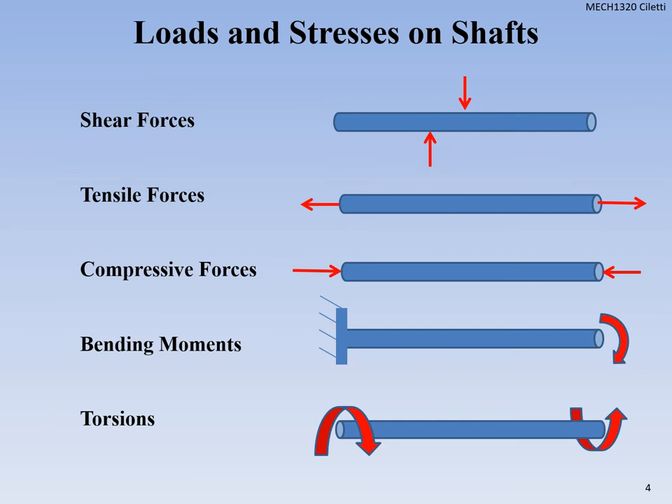Different types of stresses and strain act on shaft material. We have shear force — those are perpendicular forces to the shaft, up and down. If you have a horizontal shaft with a belt drive or chain drive, something might be pulling it down. We have tensile forces — those are pulling forces on either end of the shaft. We have compressive forces — things pushing in on the shaft from each end. We have bending moments, where the shaft bends because it's attached to something. And we have torsion or torque forces where the shaft is literally being twisted — if something isn't properly aligned on your sprocket or sheave, it pulls from one side to the other, causing torsion forces that do a lot of damage to shafts.